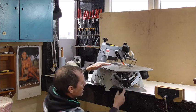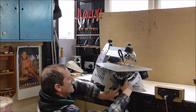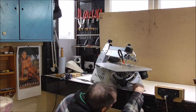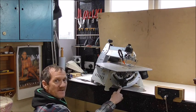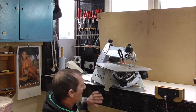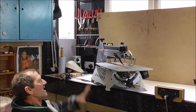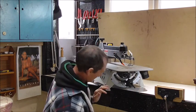Now that's one of the good points. Underneath that, there's a little press locator. Press that, take it round, and you hear it drop into the exact position. You can see the calibrations all round — protractor settings underneath there. So you've got your usual settings, but a preset to lock up, making it just that little bit easier. If I want 90 degrees, there we have it — 90. Keep your finger on it, press it, and locked off. Now I know that's 90 — I'll check it later with the blade, but once it's set, I know it is definitely 90.